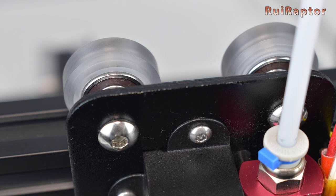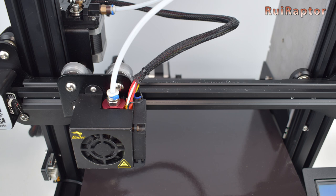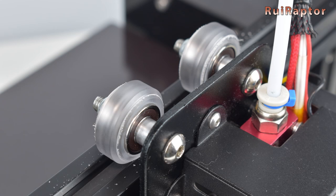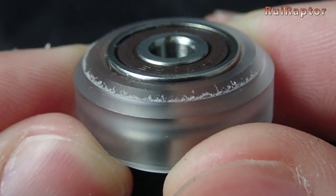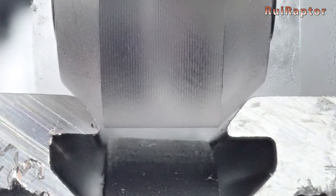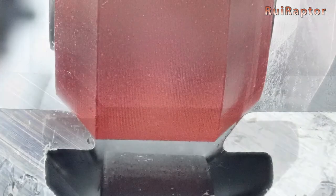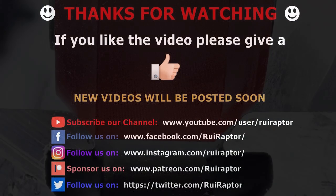However, this does not mean that you can have much tighter grip when using these wheels. They will accept a bit more grip when compared with the stock POM ones, but too much grip will wear these polycarbonate wheels as well. Although these wheels have better construction quality when it comes to the angles, we still have the issue with the profile's angle not matching the wheels. And that's it you guys, hope you liked the video, we will see you guys next time. Bye!